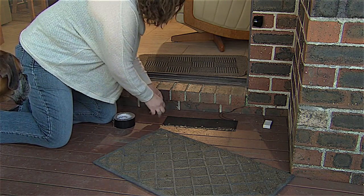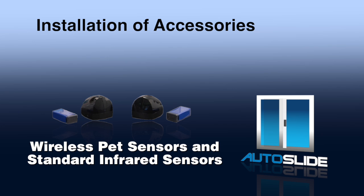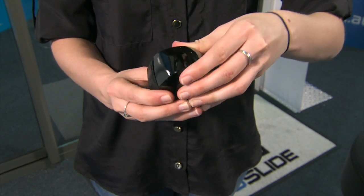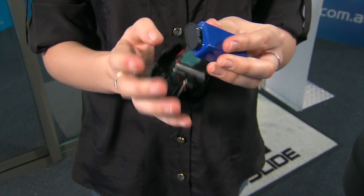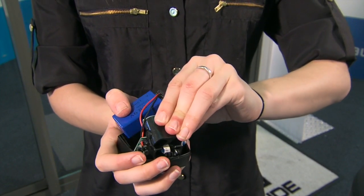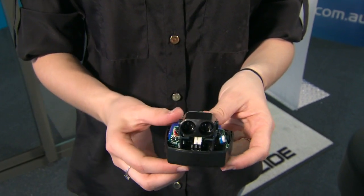The transmitter white box is fitted by double-sided tape to the frame or somewhere convenient. Once you have clipped off the cover of your sensor, pull the sensor head to one side and allow the battery to fit. Plug the battery into the leads attached and tuck the battery in behind the sensor head — the sensor blue light should now start flashing.